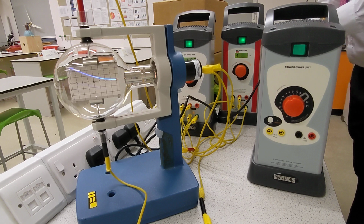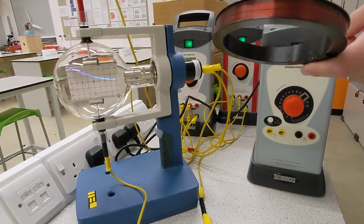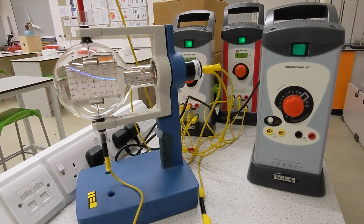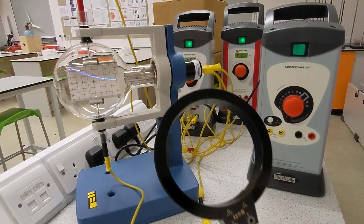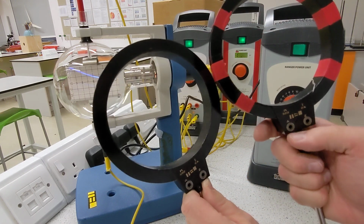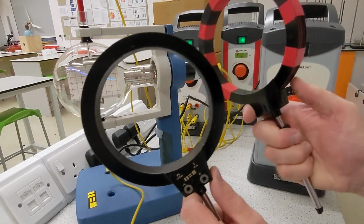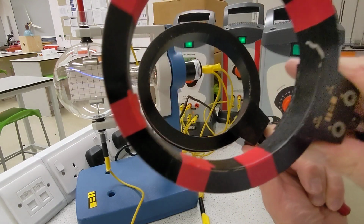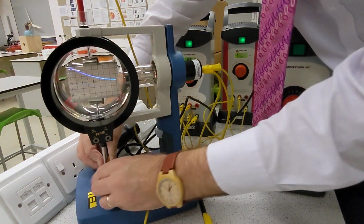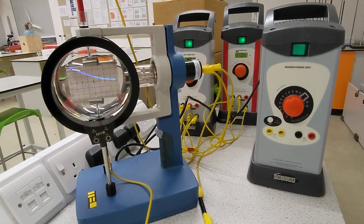We're going to use some Helmholtz coils. And here they are. They are sets of coils like this. They have 320 turns on each coil, and a maximum current through them of 2 amperes. There's the other one, here it is. My other ones had to be repaired, but I believe it's still got 320 turns. So those are your 2 coils, and you arrange them so you can get to the plug holes, like that. And the Teltron tube base has something they can slot into. A student 3D printed one of the connectors at the bottom because one of ours went missing.